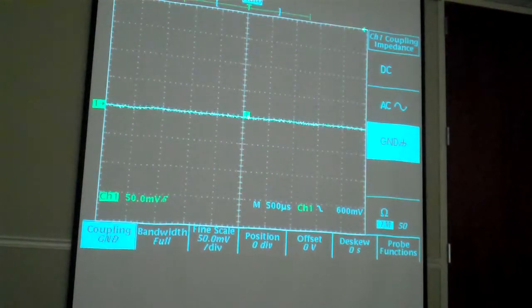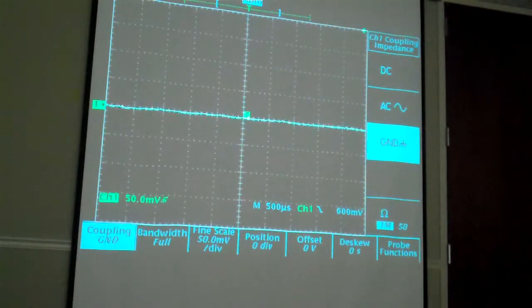There are also differential probes, if you're dealing with something that is not common mode but more normal mode operation. For example, if you're trying to sense the drive circuitry on a motor, and the motor is on an H-bridge circuit, both ends of the motor are floating. How do you observe that across the motor? You have to have a probe that has 2 differential signal inputs. I use that commonly whenever I do motor couplings.